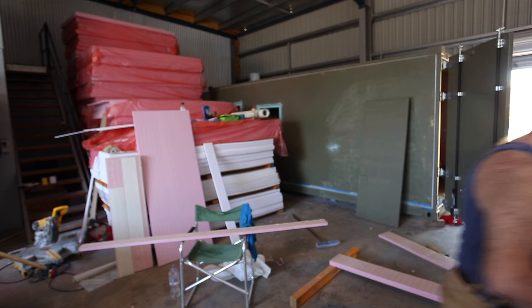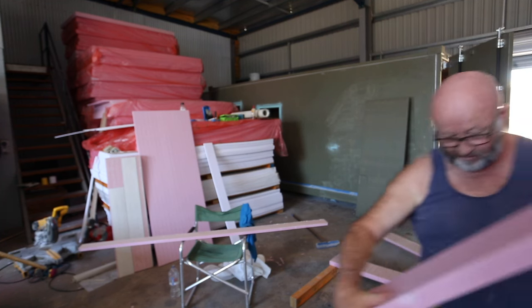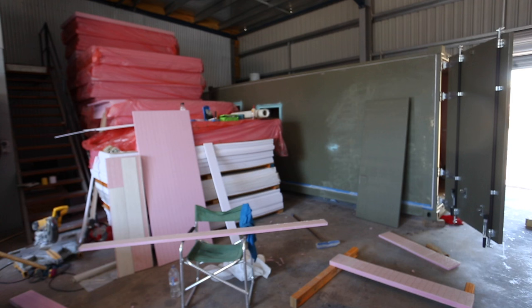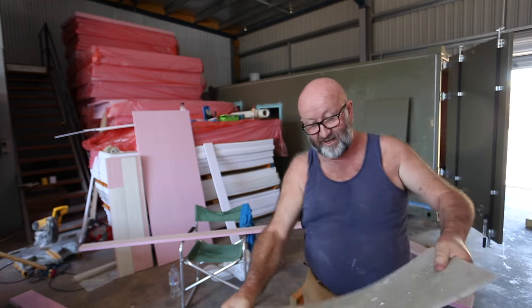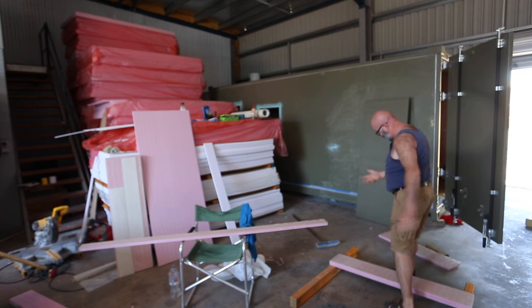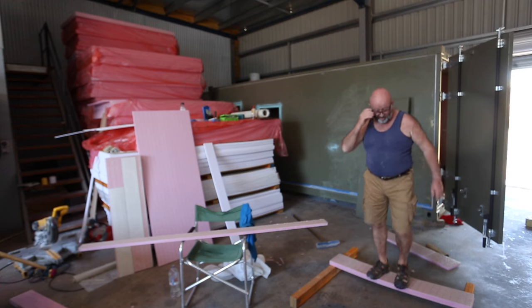So a bit of foam normally, look at that, no strength at all. And four layers of 450, and flex it. It's not very strong at all. Both together, this is the same thing, one layer of 450 on the side, and you know, that's pretty strong really.